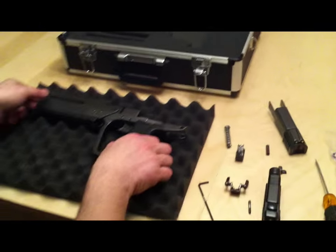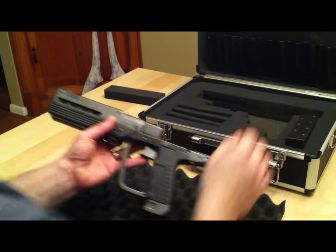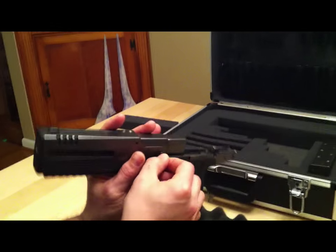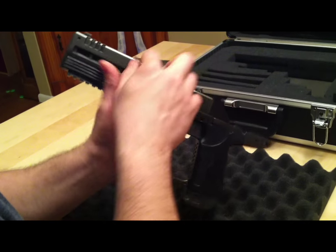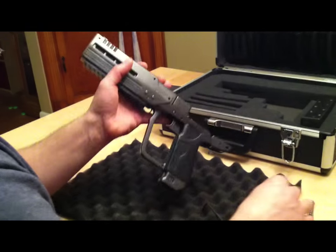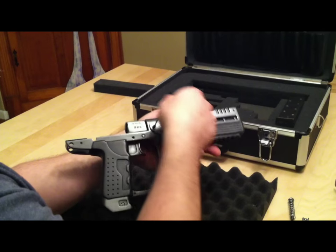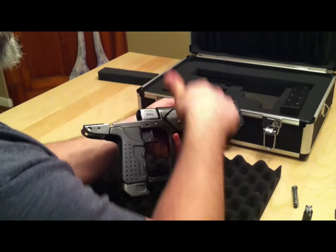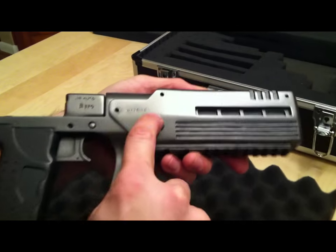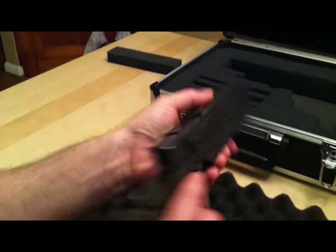So set that aside. Now the last piece to take off here is the silencer in the front, and that is two hex bolts right here. And again, you want to be careful not to scratch the paint. So be careful not to slide if you're holding any tools onto this part. And sort of back those out. And this right here is where I did that extra engraving, where it used to say Made in Idaho, and now it says Madeline, which I thought was kind of cool.